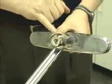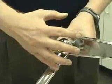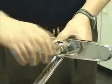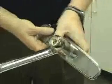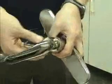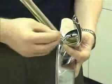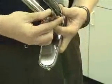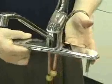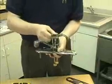If you've got two hands, one thing that can ease tightening up the dome is to push down on it while you're tightening, that way you're not trying to force the springs down. It's now snugged up and it's time to replace the handle. You take the handle, insert it back down on the stem, tighten up the set screw, and replace the plastic indicator for the set screw — pop it in good and solid. We've now changed the stainless steel ball on this particular faucet. Thank you.